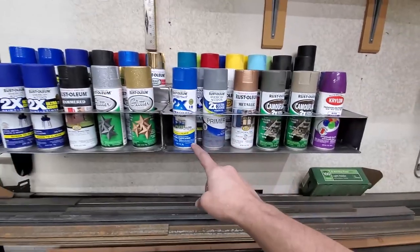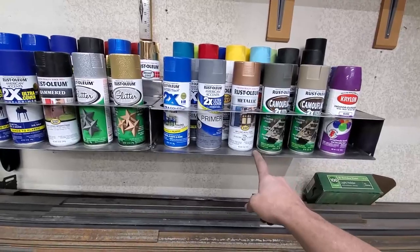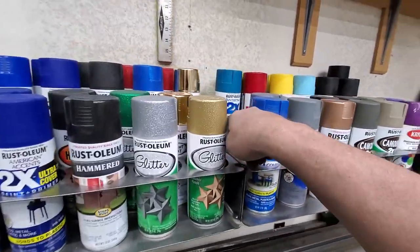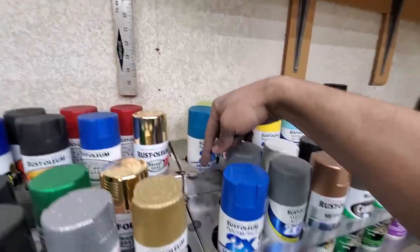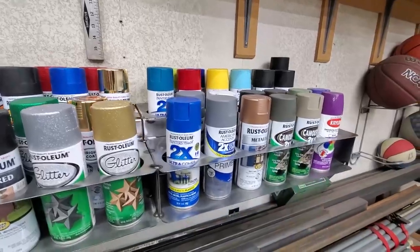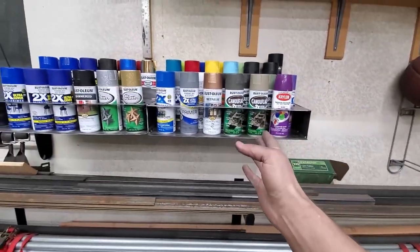This second one came out a bit better. It's a little bit more square. I bent most of it much easier except for one final bend. It was this one right here. I ended up having to cut this area right here a little bit, bend it by hand, and then I just stitched it back with some welds. But it did come out more square.